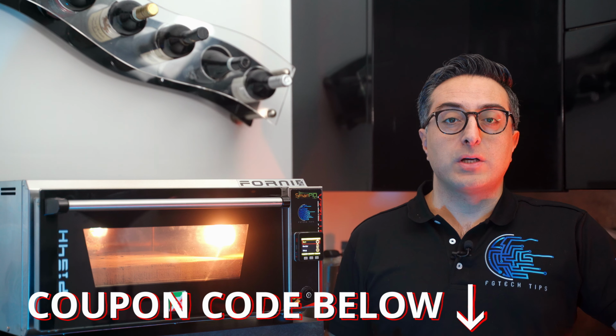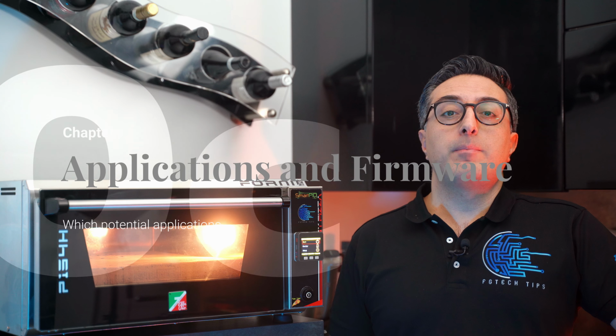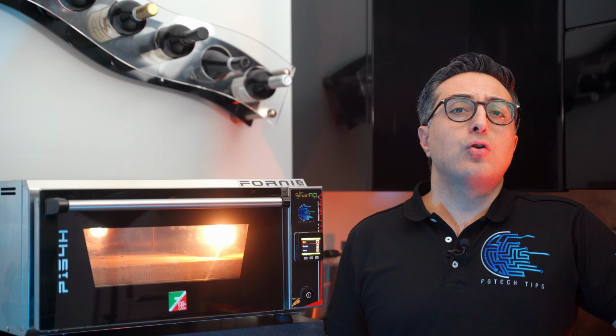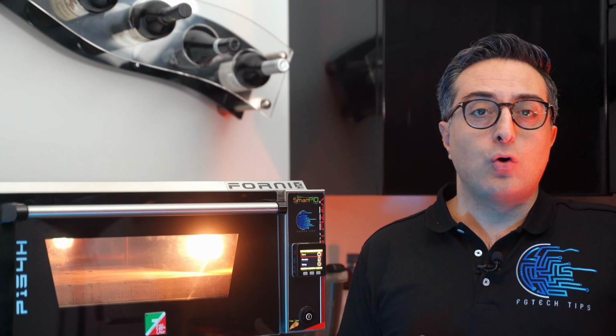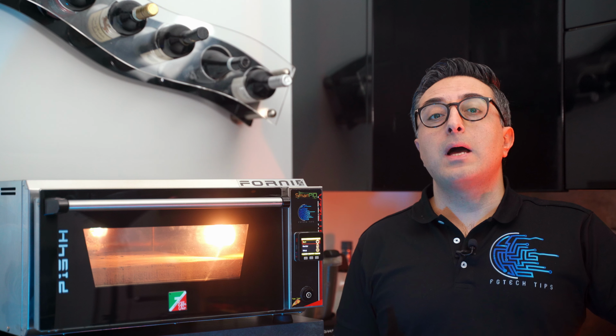We are talking about an Arduino based PID controller designed to automate manufacturing processes and with a current generic smart thermostat application, which is meant for general use on all types of ovens, furnace ovens, beer fermentation cellars, or even industrial processes, we can anyway obtain excellent results even with pizza ovens. With a single device, there are two independent channels with a top and bottom temperature and or power control, baking profiles, and also other functions.